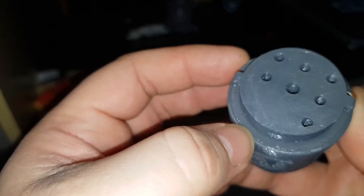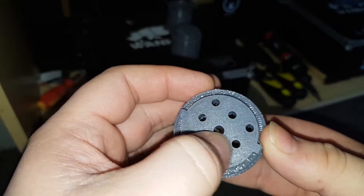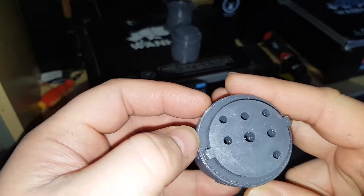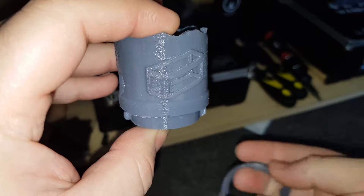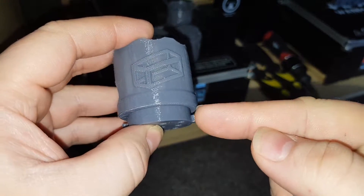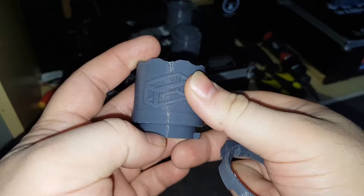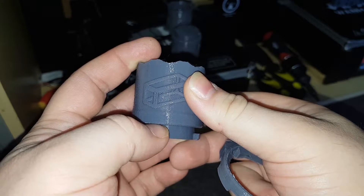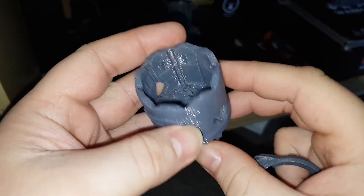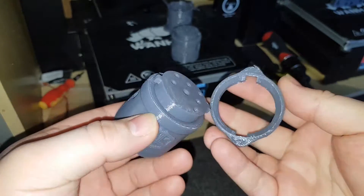You can see that these surfaces are quite difficult to achieve when they're not flat on the bed. So you can see that the bed here — this is what was touching the bed — and here this part was not. So it's not as smooth on this lip because of course it was touching the top of that support. So I hope that makes sense. If this didn't exist, the plastic would just fall when it got to this point. It would start where my nail is, the print there. Then this would work up layer by layer by layer, and finally it gets here and the first large circle here would simply drop down. So I hope that explains a little bit about why we need support material on 3D prints.